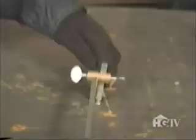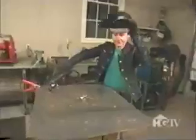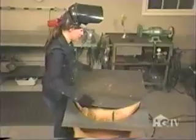I'm gonna make the lid from this piece of metal. I get to use my newest tool. It's a compass that fits onto my plasma cutter to cut circles. I just have to tighten this screw, and this point goes on the center mark, and I will begin to cut and pull the trigger and follow all the way around, cutting my circle. The circle is cut out.